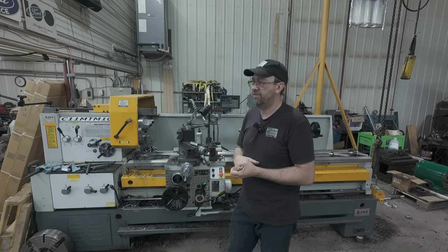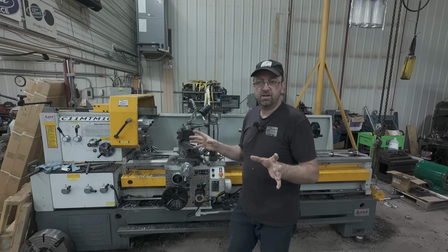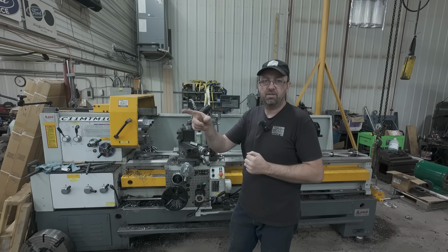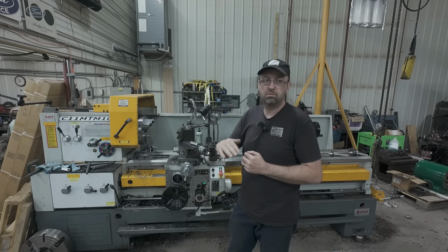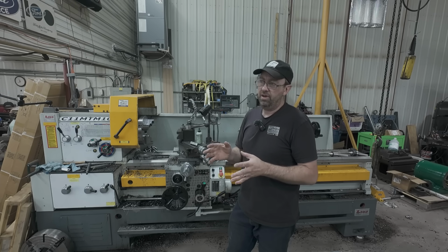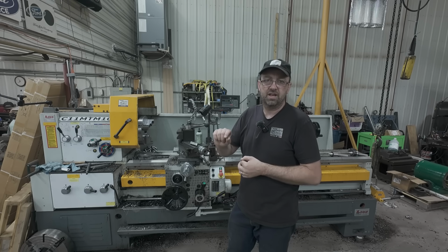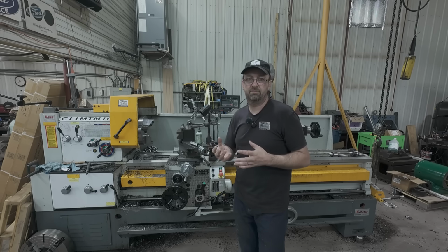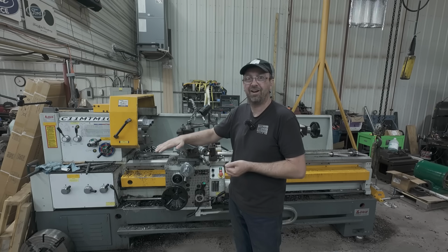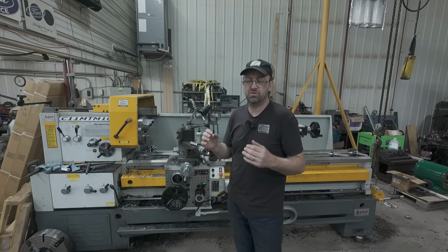I used to turn some vibratory shafts. They were a 4-inch shaft, 2 feet long, and I'd turn down each end for bearings, and they were 3/8 of an inch offset. I could run those right at 500 RPM on the Monarch lathe, and no change at all in the machine. You didn't feel it at all. That offset was enough to make a 4-ton machine bounce off the concrete almost an eighth to a quarter inch. It was a vibratory asphalt roller, so it would make that machine bounce and walk across the floor. But the lathe like that, it didn't have issues. It was kind of interesting how that worked.